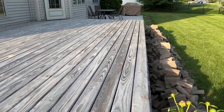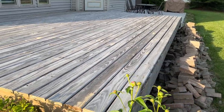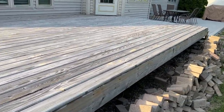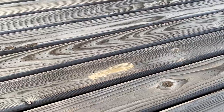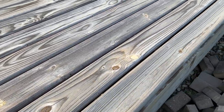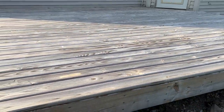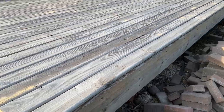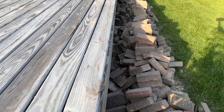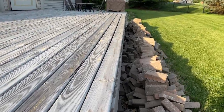You might also notice there are no seams — these were 24-foot-long boards, which were huge. When you get boards of that length, you're going to have imperfections because they deliver them to your house and you only get so many extras. I tried filling in some of the knots and defects with Bondo wood filler. It worked okay, but I think once I seal the deck, those are really going to stand out and not look that great. Another error is that my board layout left me with zero overhang on the end of the deck, which is definitely not ideal.